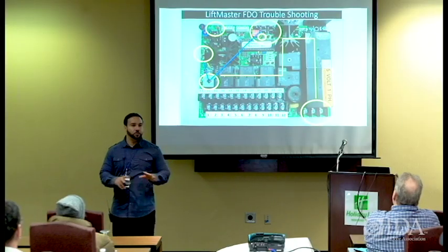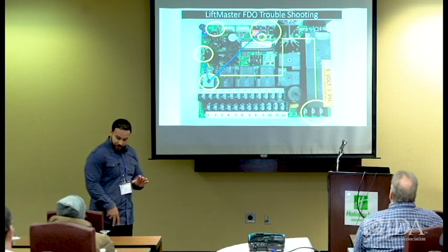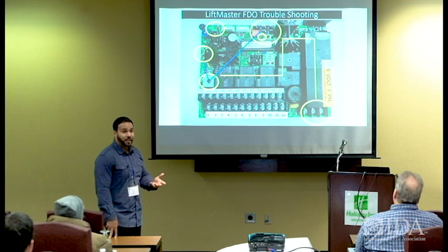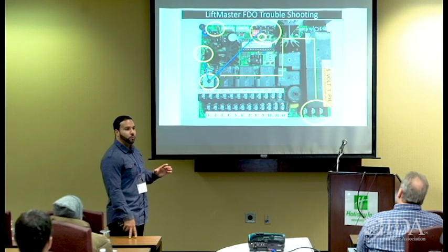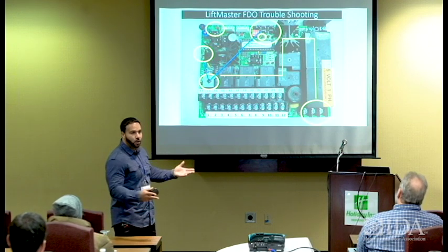And that's when you've got a catastrophic moment there. You've got a complete failure. You've lost 3 or 4 components in this operator that are very expensive. We try to protect the board because it's the most expensive component in the whole operator. Therefore, we try to put things in place to protect it before it goes down, like fuses, like just making sure that you don't get that high voltage power going to that low voltage side. You do that by putting in the proper resistors, capacitors, and other components that are advantageous to the whole system, where it just filters it out, like overloads, right?